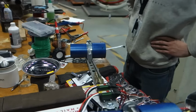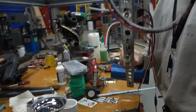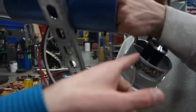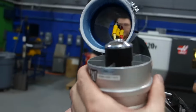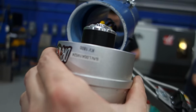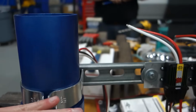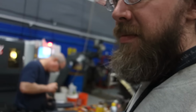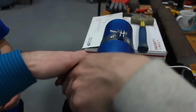So what else we got going on? Cool. We'll have to test rotation before we mount them in. But because we can plug and unplug them, that's pretty easy to do. And no, we can mount it in and then all your things are the right length, and we can leave a service loop in the tube. Because we have to test rotation, but to change rotation, we just got to swap any two.